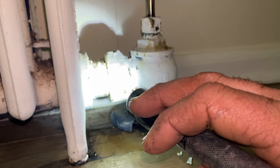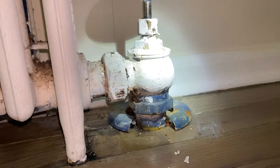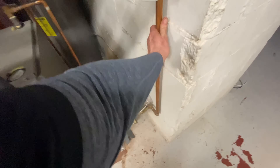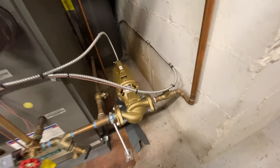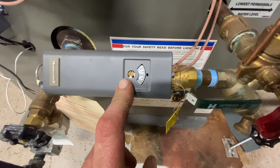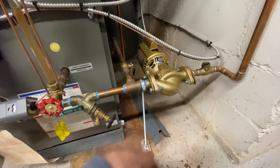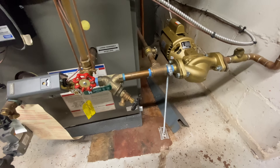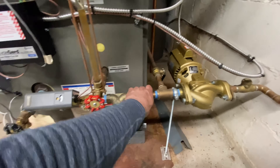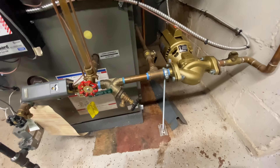Oh wait, this is not fantastic - it feels huge. I'm going to turn it off. See what happens when it cools and comes back on. So here's the boiler - I turned the steam part off. Got a hot water loop on here. That pipe's pretty cold - we're not moving water. Set for 180, that's pretty high. We're not even pulling water through. This might be straight plugged up or it could be air bound. So this is almost like I have a cold boiler - the pipe's not that hot, and I mean these are cooking. So I have an issue with that too.